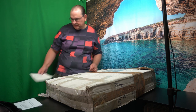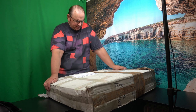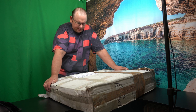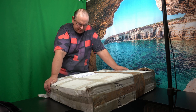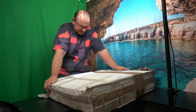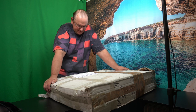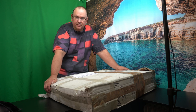It's 22 kilograms of electronics. So, what do we have here? I got a cheat sheet. This is an older generation fabric interconnect from Cisco — the Cisco UCS 6296UP. Basically it's a two rack unit, and the idea is that it's an interconnect unit for 10 gigabit connections and Fiber Channel over Ethernet. It has a total throughput of 1920 gigabits per second on 96 ports if fully decked out. This one is not fully decked out — it has 48 ports.